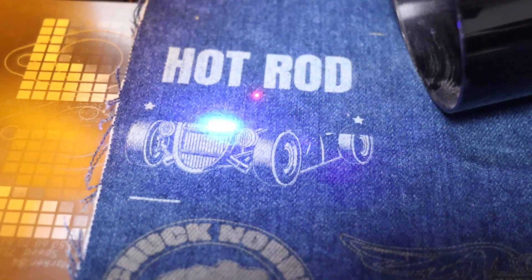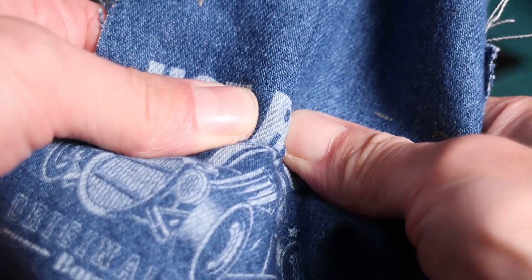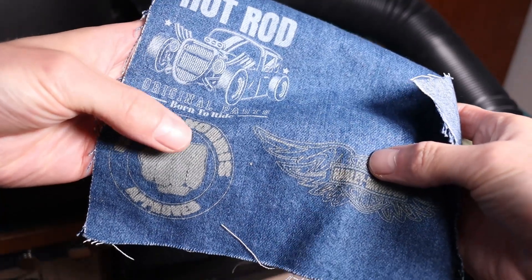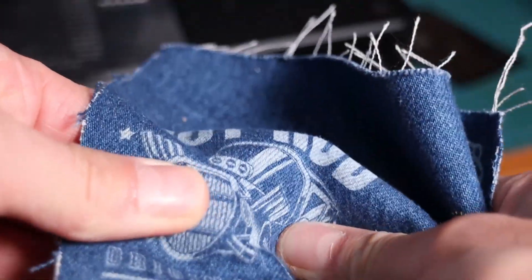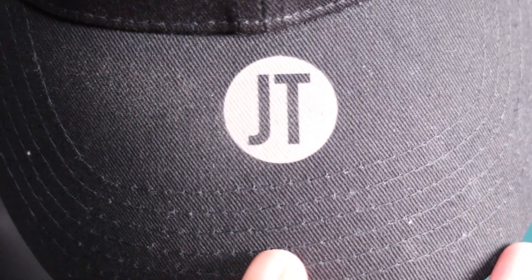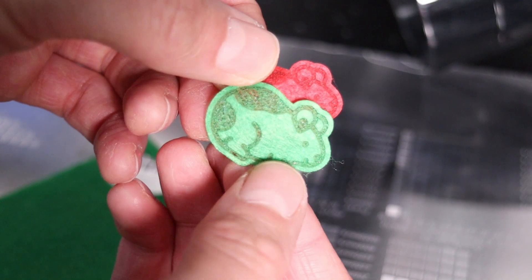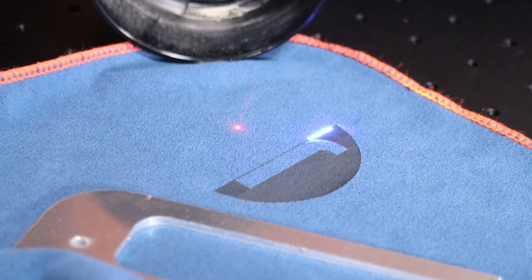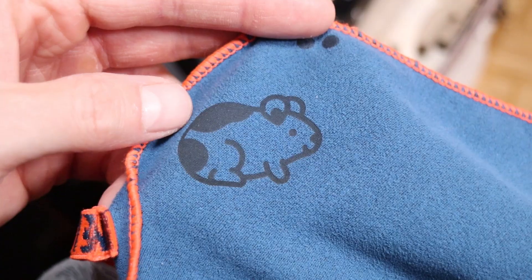This machine is excellent for engraving different types of fabrics. Because it's gentle and produces little heat, it can easily remove color from the surface of dyed fabrics like denim. The UV laser ablates the dye while leaving the fabric fibers intact, preserving the fabric strength. For comparison, the two engravings at the bottom were made with a diode laser, which created darker engravings but reduced the fabric strength due to the heat. UV lasers are commonly used to create artificial wear patterns on jeans. I also engraved a black hat with great success. Thin felt is perfect for making Christmas decorations or similar items, as it can be engraved and cut very quickly. I also tested a polyester sports towel — the laser darkens the material and removes the fine fluff on top, with no damage to the towel's structure, allowing it to retain its durability.